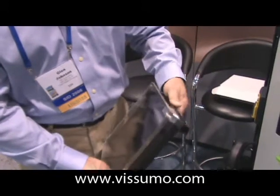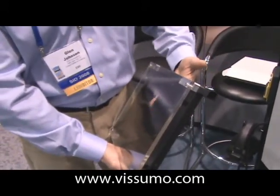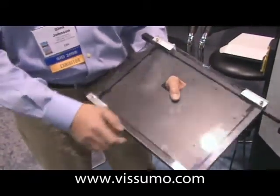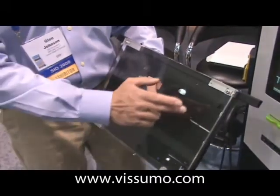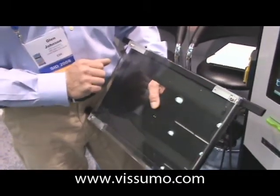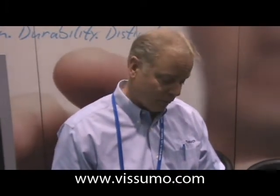What we've basically done is taken a monitor or display, built a bracket for it where we installed the monitor on the back side, and then we overlay that with whatever touch material you'd like to make your touch panel out of. A simple touch — the force of your touch is transmitted out through the sensors back into an analog to digital converter, to a DSP, and that gives us the XY coordinate of the touch.